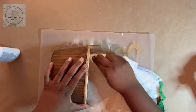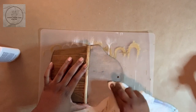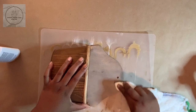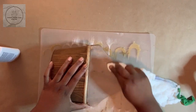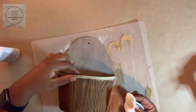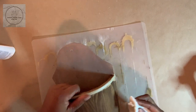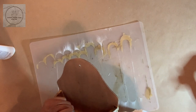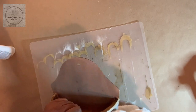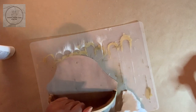You don't want to leave any excess — you want to make sure that you're rubbing it all in and you don't see any excess, but you want to make sure it goes down into the grain of the wood. That way, when you come back and buff it out, you'll see the actual wax that has built up in the crevices of the wood. I'm going to do just the front and the bottom of this, since this will be against either a wall or a door.